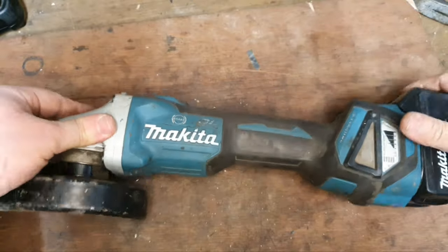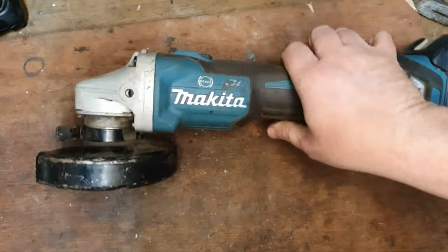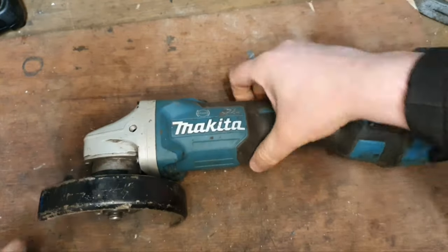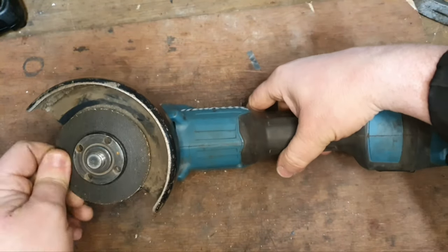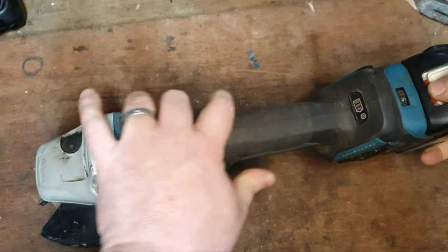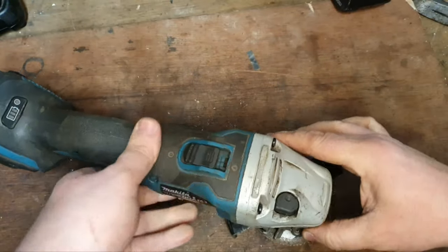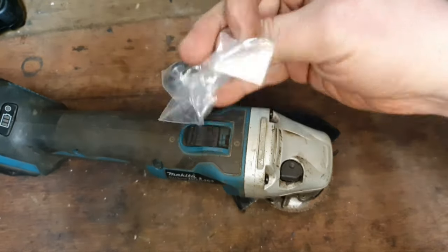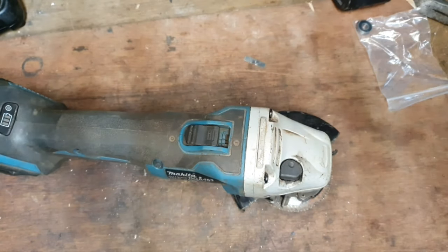Welcome to my channel. Today we've got this Makita DGA463. And she's noisy. I featured this last week on my channel and showed you what the fault was. It was a bearing, so I'm going to show you how to replace the bearing now. That's what we need to replace.